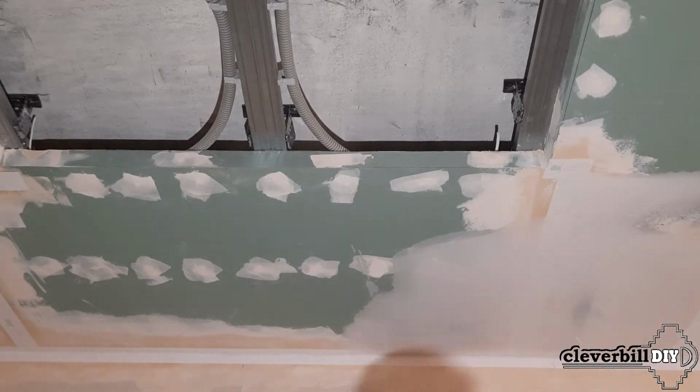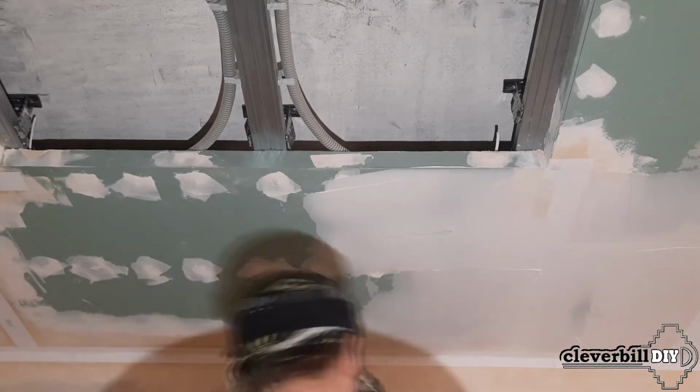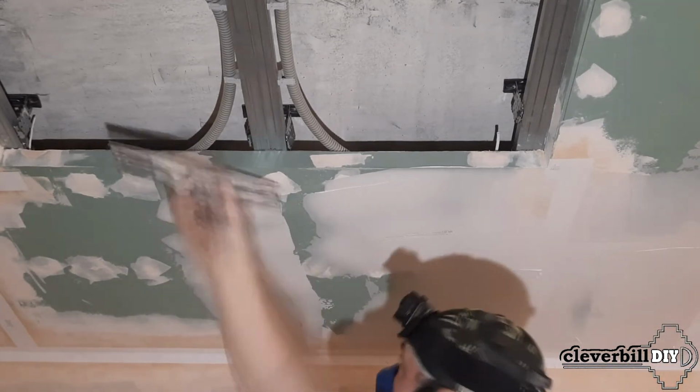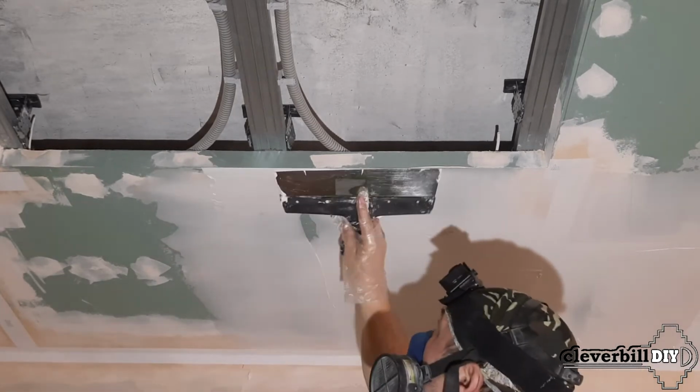Therefore, if there is a need to apply glass mesh to the ceiling, really assess your strength. Perhaps it will be much easier, having lost one day, to glue the glass mesh on a special glue, and then, calmly, apply a layer of putty on the already glued glass mesh.